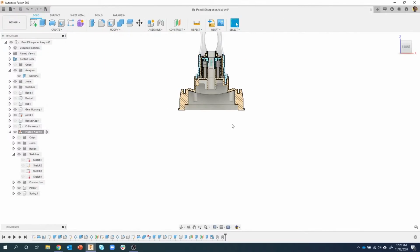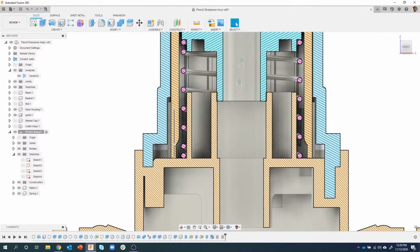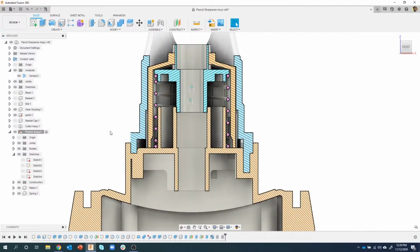So it does a little bit of calculation. I'm going to zoom back up, and we can see that this part now sits where it needs to sit, instead of being down under. So remember, just as a quick review, we took a measurement from this edge to the other edge where it was sunk down, and we captured that distance. We went back to the defining sketch and just changed its height by what that exact dimension was. So hopefully that makes sense.